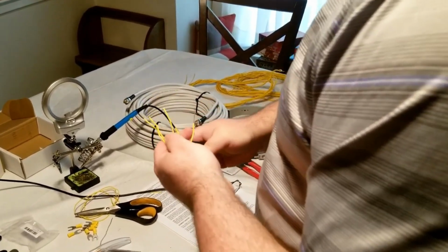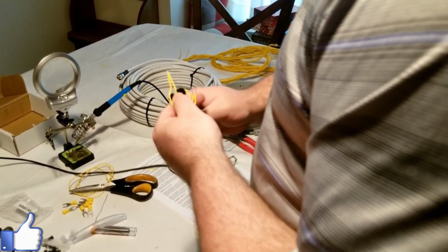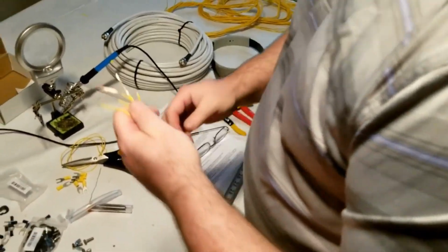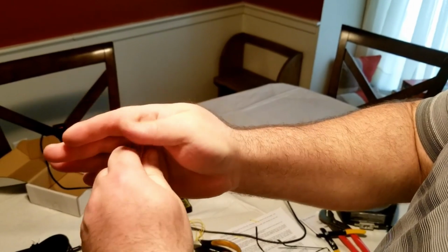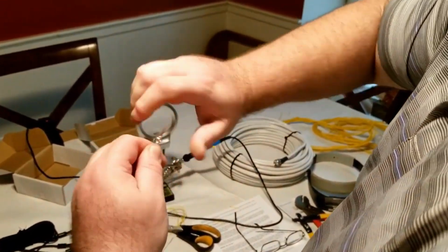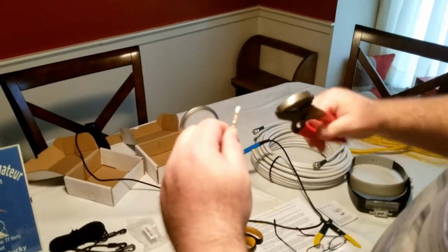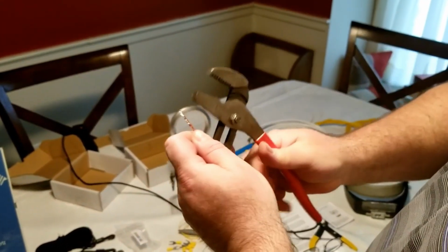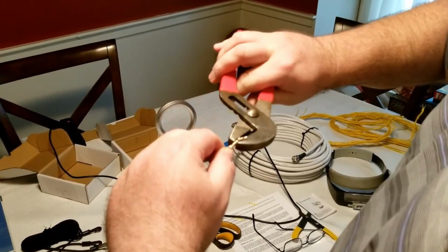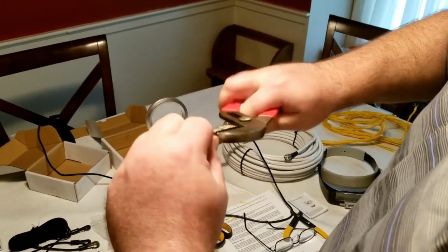So I'm putting together several assemblies here, which is how he's designed the antenna. I purchased some additional wire to do this, that yellow wire. It comes with DX or D10 is the original wire type. It's a very decent wire, and I wanted to save the black wire for the elements. I knew I was going to be putting up an 80 meter inverted L, doing everything pretty much at quarter waves. I do have a full length 6 meter though, and so I wanted to save that wire. So I bought this thin, inexpensive yellow wire. I think it's technically for invisible fences for electronic dog collars and things, something like that. It's cheap, it's easy to work with.